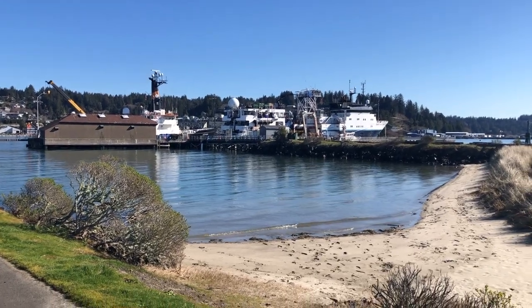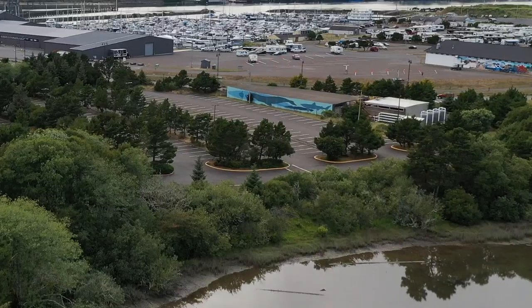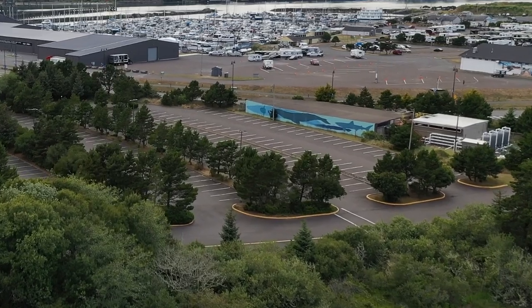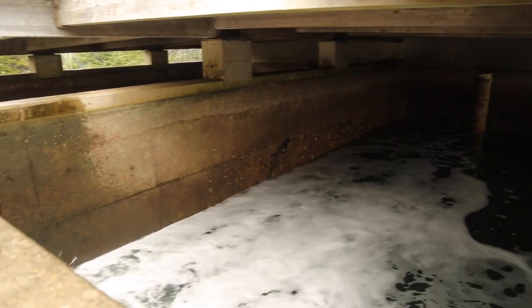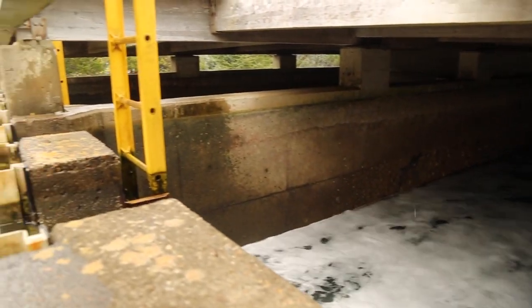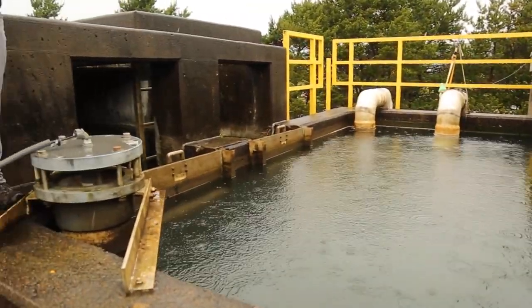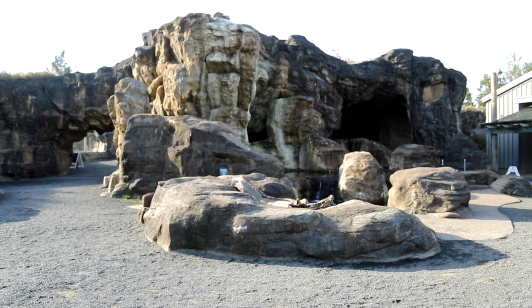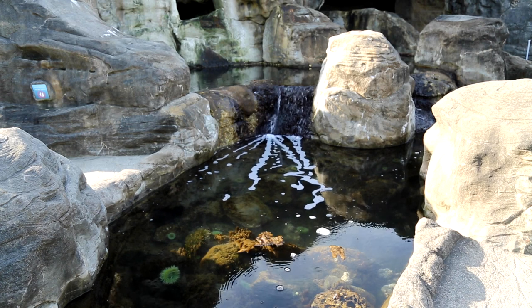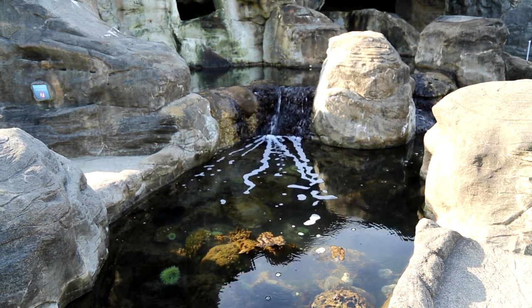Our intake system is about 3,000 feet away from our seawater storage. We pump it to seawater storage and store half a million gallons of raw, unfiltered seawater in two separate reservoirs, so we have the ability to drain one to clean it. We do that biannually, swapping back and forth between the two. We do utilize a little of this raw water to the main building for our outdoor wave crash exhibit, which has a lot of filter feeders — so we don't filter that water before sending it to that exhibit so they can feed on it.